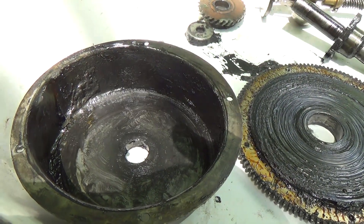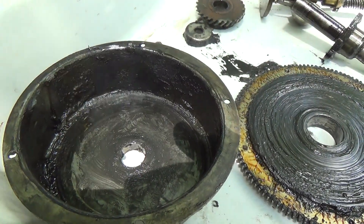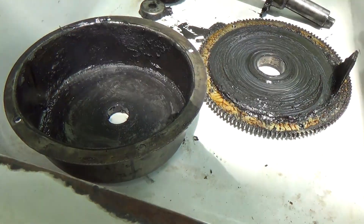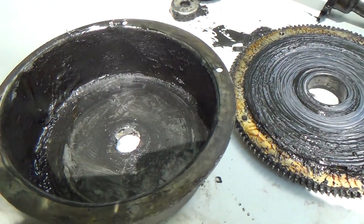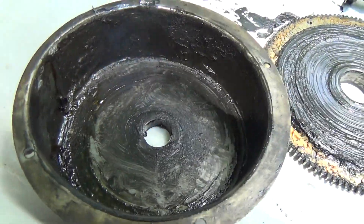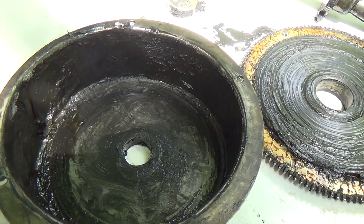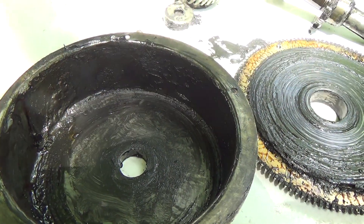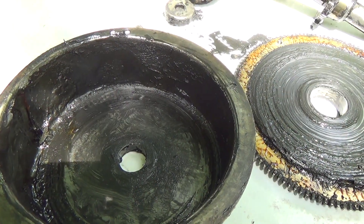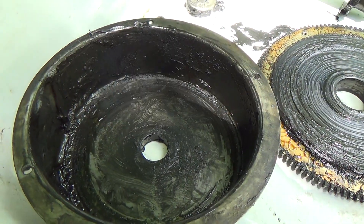It's hard enough taking them out when they're greasy. Putting them back in — especially if it's a new spring with a lot of tension — if that thing's all greased up, it can get away from you, especially if you're not used to it. So I put them in dry. You want a nice dry spring and a nice dry spring barrel so your nice heavy leather gloves will grip the metal firmly, and you can get that spring in there with a minimum of difficulty.